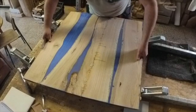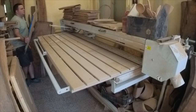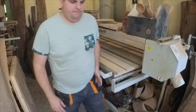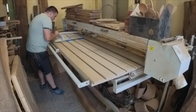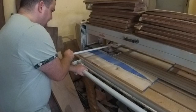We did our glue-up, so now we just needed to sand to perfection. Don't forget to connect your vacuum to your device, especially if you are sanding. For the belt sander, I'm using three grits: 80 grit, 100 grit, and 150 grit.